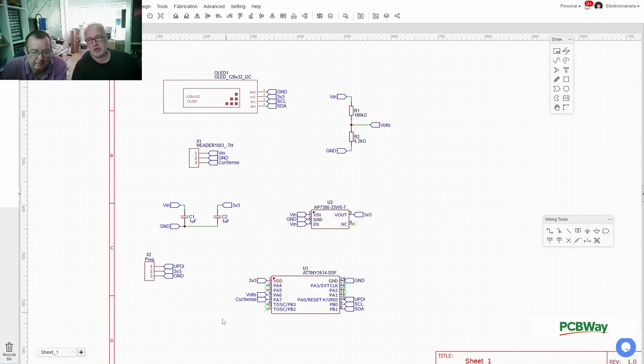And then I only need two inputs, by name volts and current sense. Follow me with the current sense. The current sense comes directly from the header, and by that, directly from the motherboard, from the multi-load board. This is for the 50 milliohm current sensing resistor. So even if it says current sense, this is an analog voltage. So we drop this directly into the CPU. Again, normally this voltage should never go above 3.3 volts. No. If it does, you have a different problem. Correct. Believe me, the little CPU baking here isn't your main problem. No, anymore. Exactly. It's true.